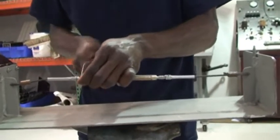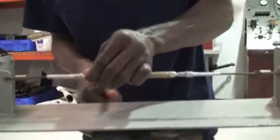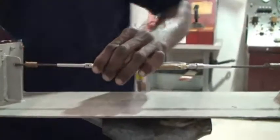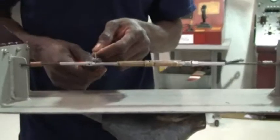Minimum of four wraps on each side. In the process we are careful not to change the tension that was already set in the tension meter. That's why you keep your hand held on to the turnbuckle.